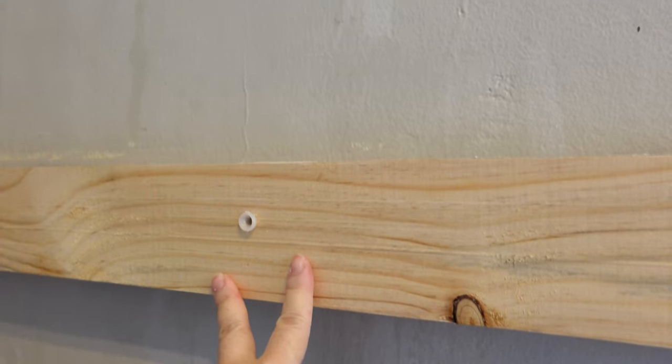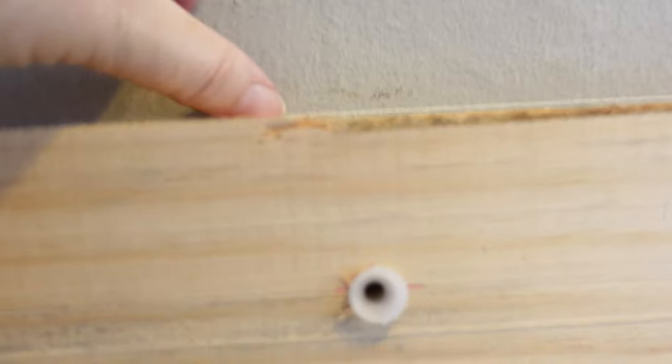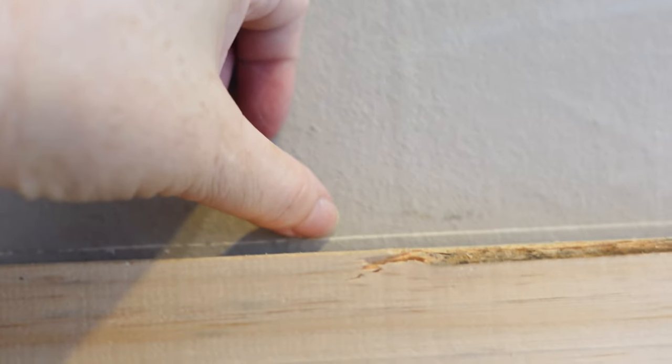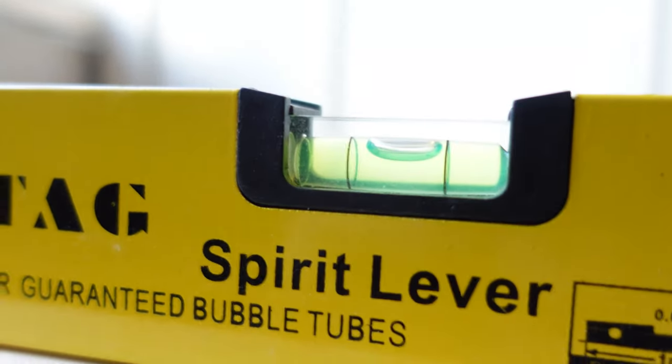You see, it's off the line. But the good news is all the holes I measured coincided with the holes on the wall. It looks like my wood is slightly lower than what I scored on the wall. The thing is, the spirit level shows that it's level — and if I add a slat, it's level.